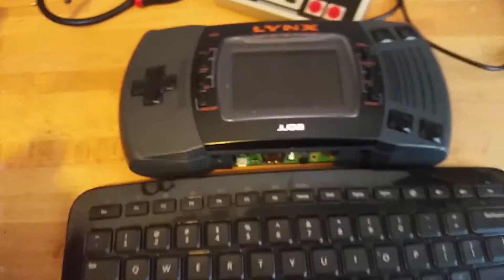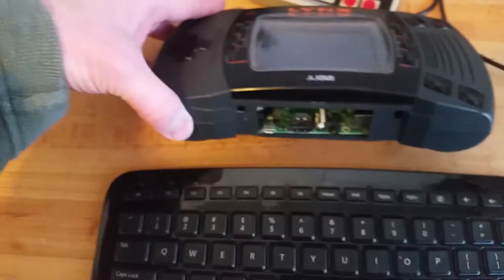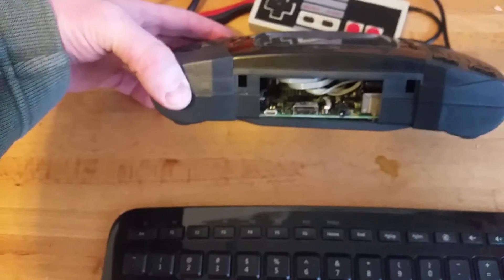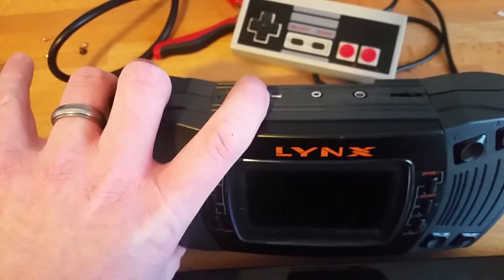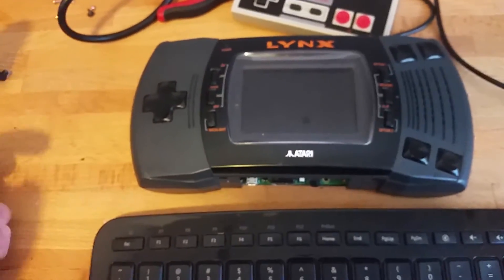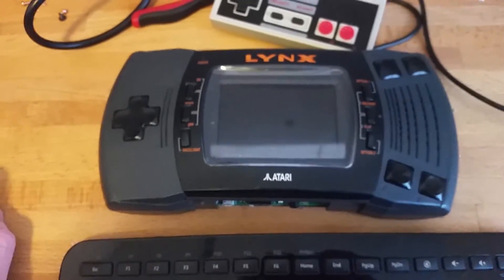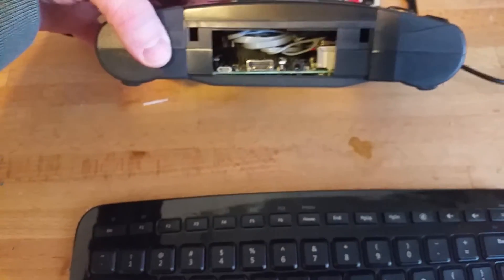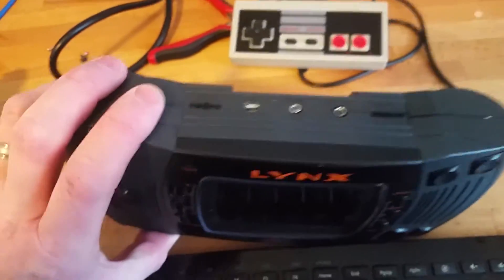Overall, yeah, a really fun project — I'm really happy with it. Just some minor tweaks to do, and then I might build another one of these. I'm thinking about actually using the original battery tray, putting all the double-As in there and retaining the original power jack, and just down-converting everything from 9 volts to 5 volts. That would actually be better — I'd have more voltage for the audio circuitry, it would cut the cost, and make it a little bit easier, though I wouldn't have all the stuff exposed in the bottom, which I actually kind of like.